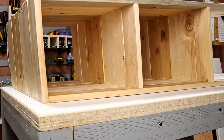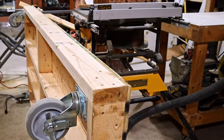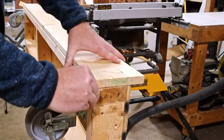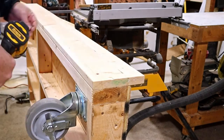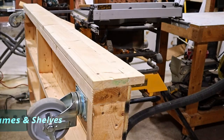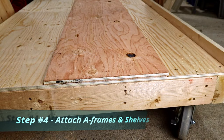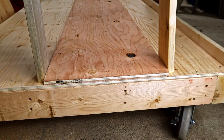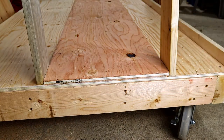Now I have 8 of these all ready to go. But before I move on to the next step, I'm going to add a board to the front that will keep the sheet goods from sliding off — this piece of lumber was reclaimed from my old workbench. The next step is to attach all of the A-frames to the base. For this part, I'm going to add a sheet of plywood cut to the same size as the bottom of the A-frames — this will give me something to attach them to. One edge of the plywood is cut to the same 5-degree angle as I used on the previous step. I use brad nails to attach this plywood since I only really need to keep it from sliding around while I screw down the A-frames.